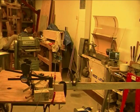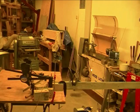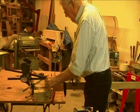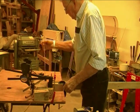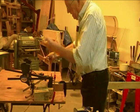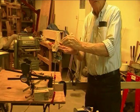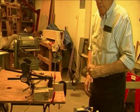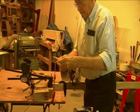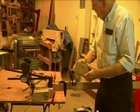I steamed it for 45 minutes again, and this time I put a little piece of baler twine in behind, between the wood and the metal here anyway, and then it comes out on this side, and as I go to release it, I can sneak this under the metal, the idea being that I'll have a way so that I can pull these things together so that when I release the clamps it doesn't open up and then I have to close it back up, which is one of the things that caused a mistake like this, I think. Well, it made it worse, that's all.